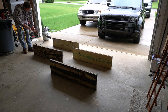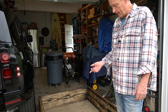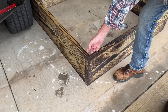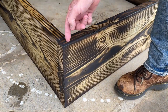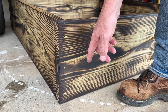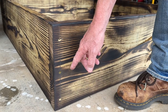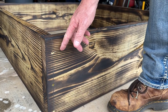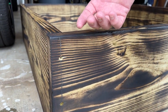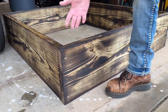I'm going to be using bigger screws to put this together. The boards are an inch and a half thick, so I divided that in half — three-quarters of an inch — and described a line. Then I went two inches down from the top, two inches from the bottom, and split the difference in the middle: two inches from the top, five and a half in the middle, nine and a half at the bottom. Then I screwed a screw into each position and backed it out as a pilot hole, putting a small screw in each of the four sides just to hold it square while assembling.